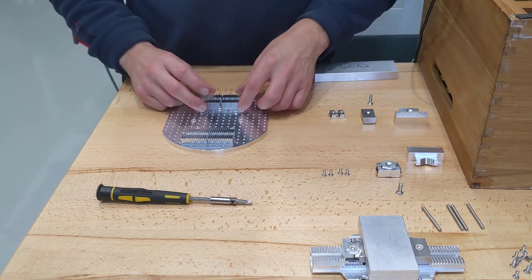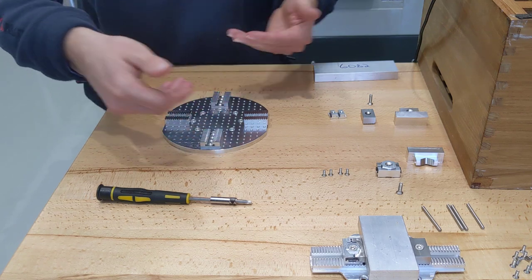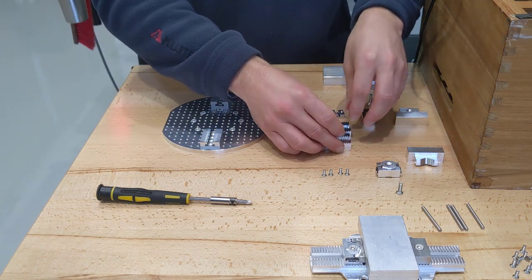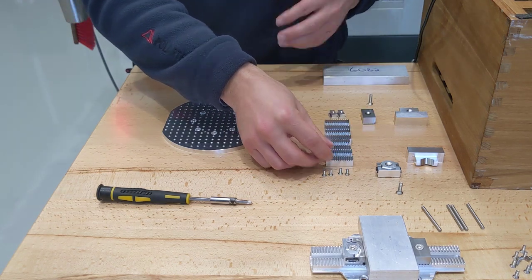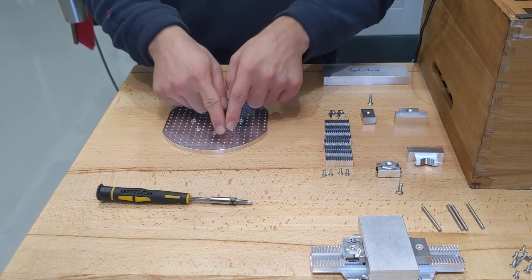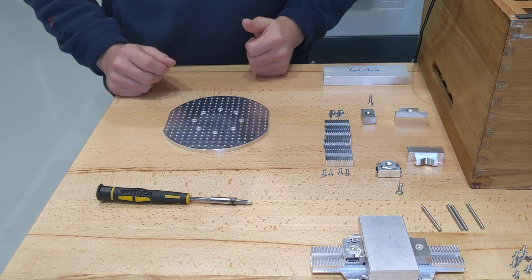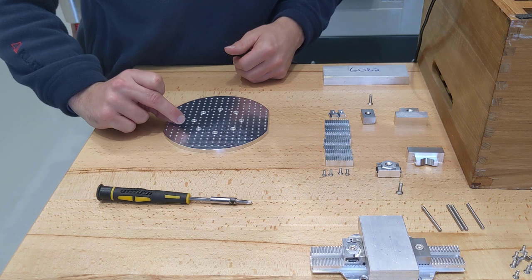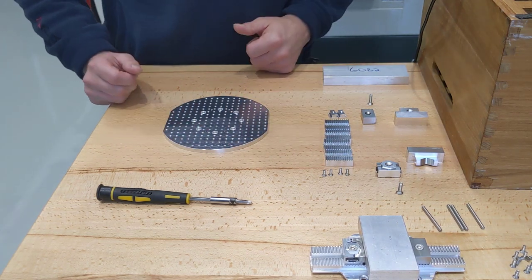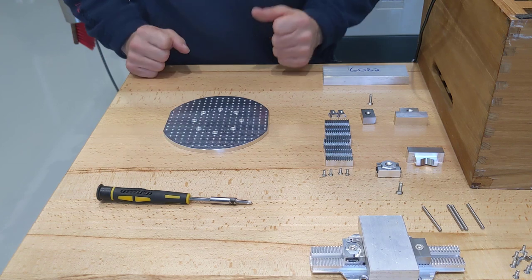You get really good clamping force. It's also good if you've got a square piece of stock — you could have two elements clamping from one side and two elements clamping from the other, so you're clamping from all sides. It gives you lots of rigidity and a really good holding force. You could also use this plate in a different way — get rid of the clamping elements and make your own. So you can use this as a base. Say you've got a flat, really thin piece of metal that you want to engrave, like a sign. A common way of doing that is putting it straight onto the fixture plate and then making your own little hold-down clamps, tightening them in so they hold onto the edges. It gives you a lot of flexibility, and it's a bit of a platform for other types of work holding.